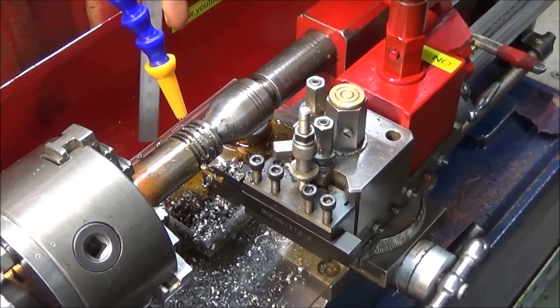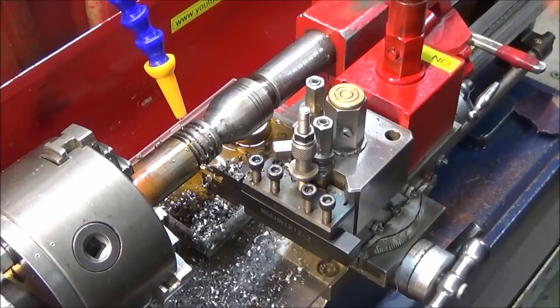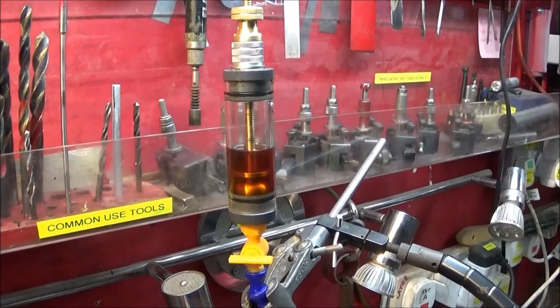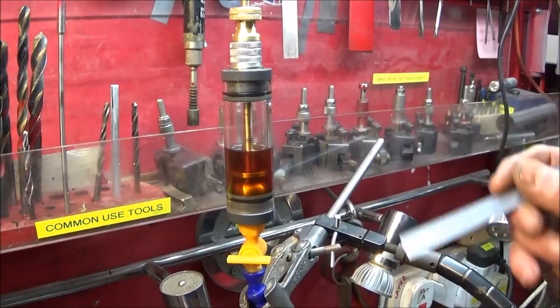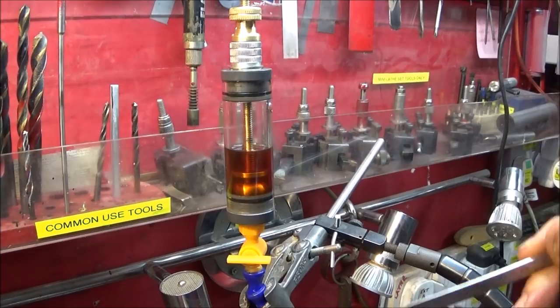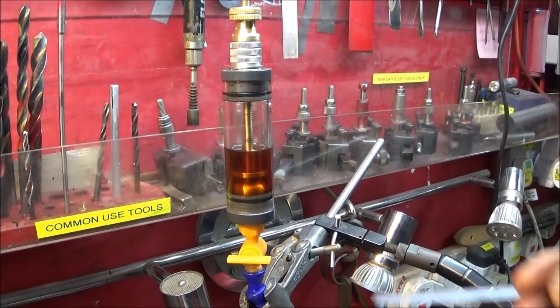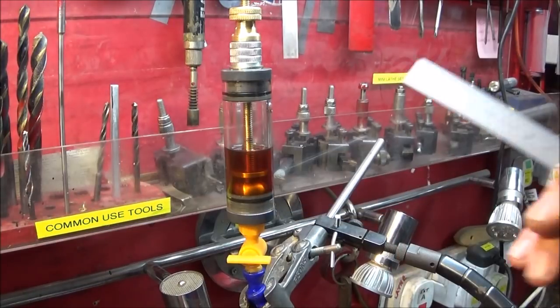When the plastic catch tray is filled up you can take it off the saddle, tip it into a jar, and filter it again for reuse in the oiler. On machining that groove you can see it hasn't used much oil — just what's needed for actual cutting. Now I'll show you this on the bench in pieces, how I made it and how I put it together.